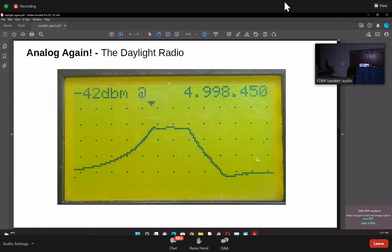On the skirt, on either of the sides, 1 kilohertz away from the carrier, your carrier suppression is almost 40 dB. There's another thing we need to be aware of, especially on transmitters: you think that for SSB, you'll get 50 dB or 60 dB of opposite sideband suppression. The fact is that your IMD coming from transmitters is hardly more than about 25 dB below the signal itself. So opposite sideband suppression beyond 25 to 30 dB does not make any difference on SSB at all, okay? Because your splatter is going to be worse than your carrier and your opposite sideband.